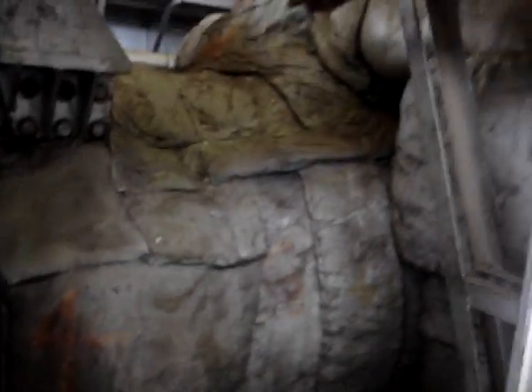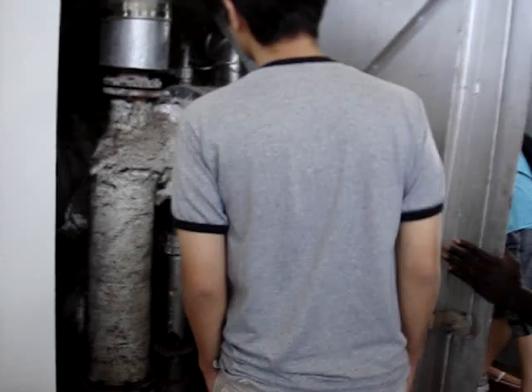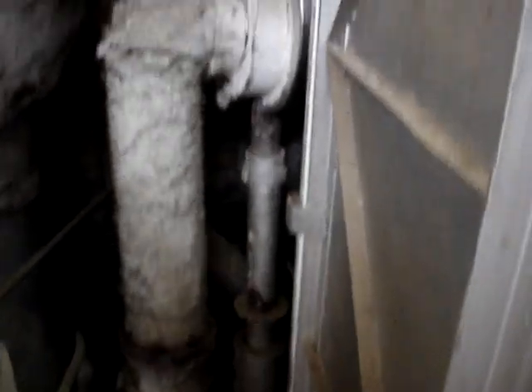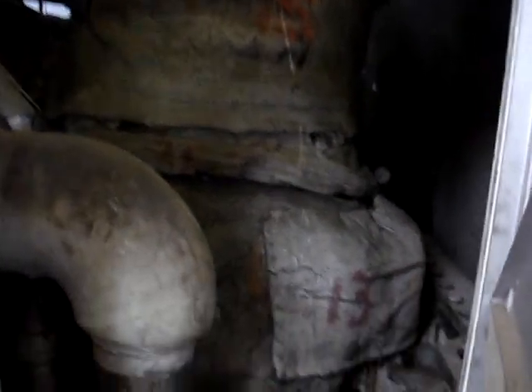Let me open these up so you can get an idea of what the inside looks like. The high-pressure turbines — and we have insulation on here. The steam comes in at 1,800 pounds per square inch and spins the shaft, turning mechanical energy into electrical energy. We have a high-pressure and intermediate pressure section. This is the high-pressure side of the turbine and control valves, intermediate pressure here, and those big gray pipes are over there. There's a crossover tube where the steam goes back and exhausts underneath.